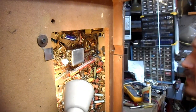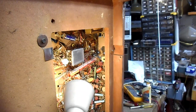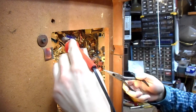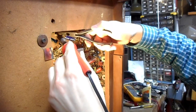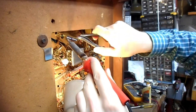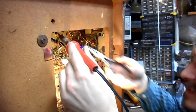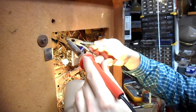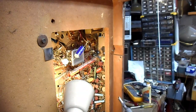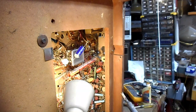Okay, that new terminal strip's in there solidly, and it's also easily removed, which is good. Now I'm going to take the failed capacitor out, and I know why this capacitor failed. This is a 340 volt B plus rail, but someone used a 250 volt capacitor on it. That is not sufficient for the job. I'm changing out a... This is also interesting. This terminal lug had some other component lead on it before, but that component was taken out in this... There are some interesting things that went on when this cap was installed.